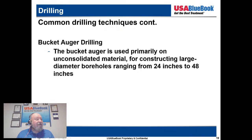Some of these wells that I worked with in City of Riverside, located in San Bernardino County, were producing 4,500 to 5,000 gallons a minute, depending on the size of the pump, where it was, and the depth. As water quality became more important, we started having to go deeper and deeper into these aquifers to get better quality water. And John, I would also say that bucket auger drilling tends to be limited by depth. There are depth constraints on that.